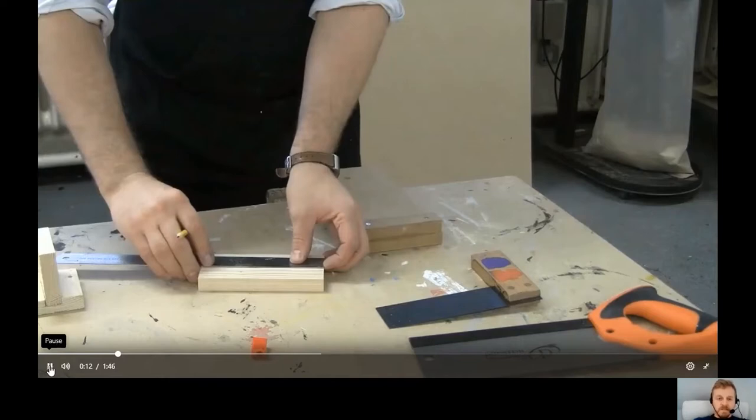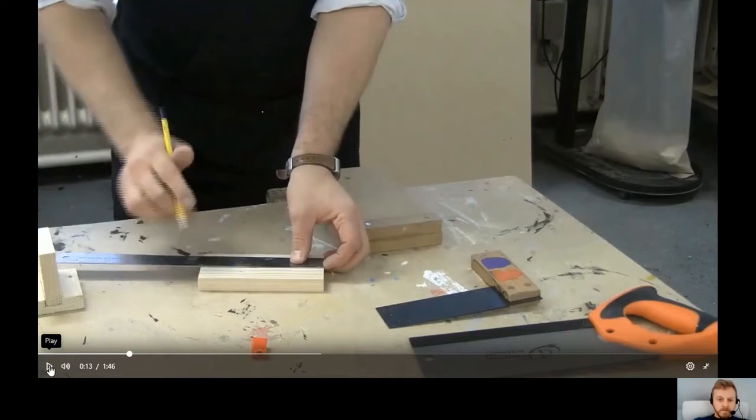For this situation we're using it to create the upright section for the stand. The piece of timber is 15 centimetres or 150 millimetres long. Push your finger tightly up against the edge of the wood so the metal ruler is level with it, then find the middle — if the piece is 150mm long, halfway is 75mm, or 7.5 centimetres.